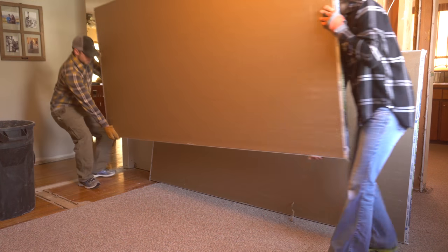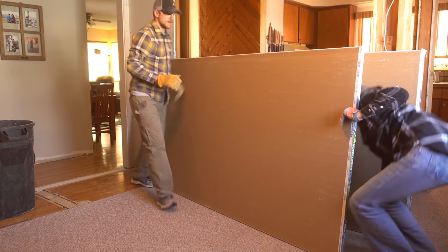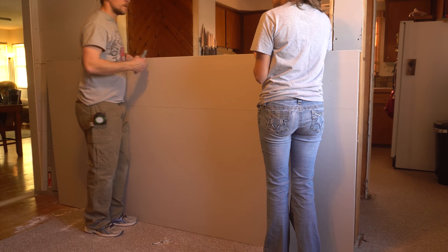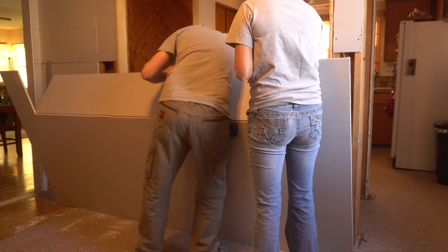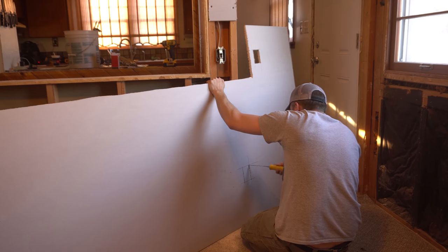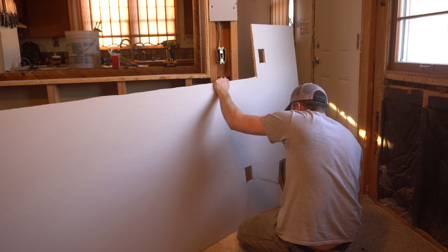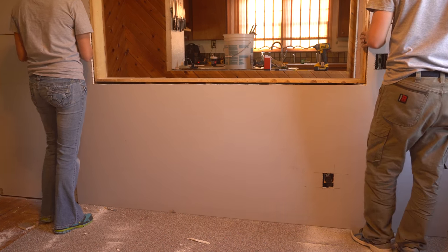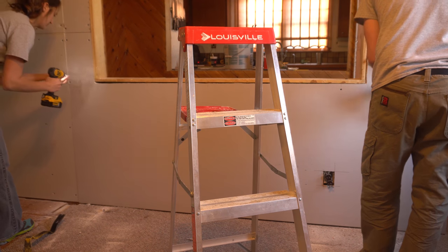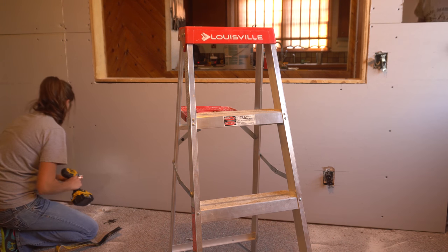We hauled in a bunch of new drywall and proceeded to hang it throughout the dining room. Hanging drywall is pretty easy. I don't claim to be an expert, and a real pro would probably laugh at me, but I've done enough of it in this house over the years that I've picked up a few good tips along the way. Mostly it's just a matter of taking one space at a time and cutting the full sheet to fit around the obstacles in the way. Sometimes you have to take pretty good measurements and mark out a position so that you can cut out specific shapes, like I'm doing for this outlet. It's really helpful to have a second person to help you move sheets around and hold things in place while the first drywall screws get driven in. Katie and I got into a pretty good rhythm of tacking up a sheet, then she would drive in all the screws while I moved on to the next piece.